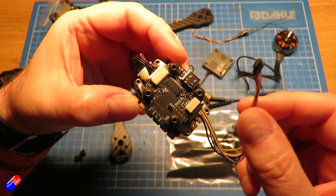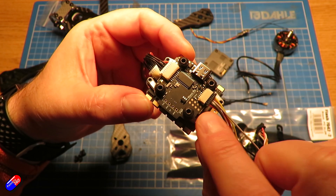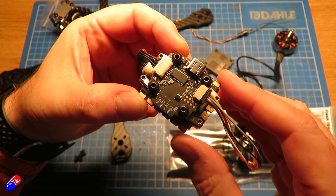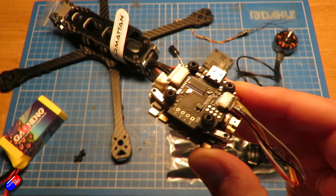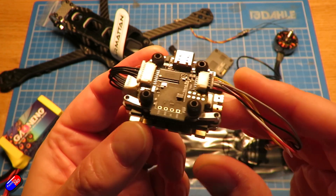This stack uses a cable at the side and it also has GPS pads with compass support via the I2C pins. That is going to allow me to have an external compass, which is going to allow iNav to work brilliantly even in windier conditions. This flight controller only weighs about 4.51 grams.